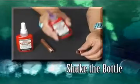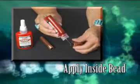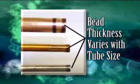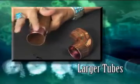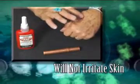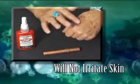Next, shake the bottle of HVAC Super Pro and apply a bead of Super Pro around the leading edge of the inside of the connector and the outside leading edge of the tube. The thickness of the bead depends on the size of the tubing. On larger tubing, it is best to spread the Super Pro over the entire bonding area of the inside of the connector and the outside of the tube. HVAC Super Pro is not a glue. It is non-toxic and will not irritate skin.